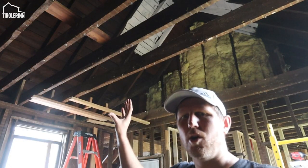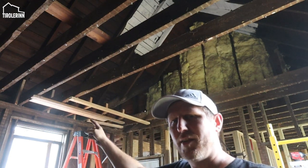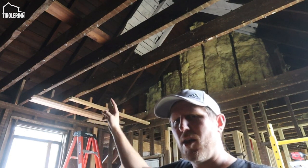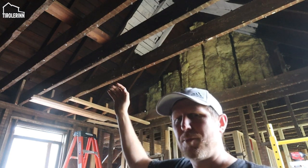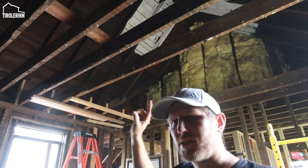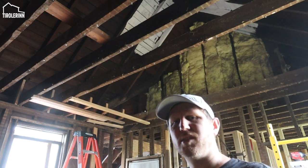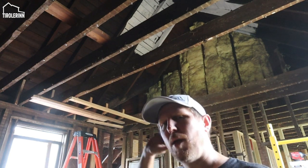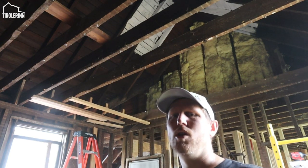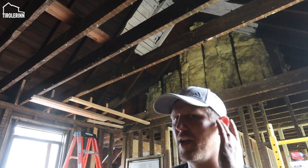So next week, on the far side over here, we will add the same kind of joists that we already have on this side, so that we can put the roof on top again, and then I'm going to sister joists that go all the way, so we can compress it, have extra strength, extra support along the whole way, and maybe we even get to putting some of the flooring right above so that we can actually start walking on there on the loft area.